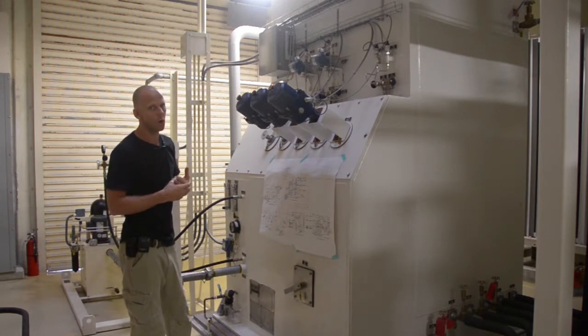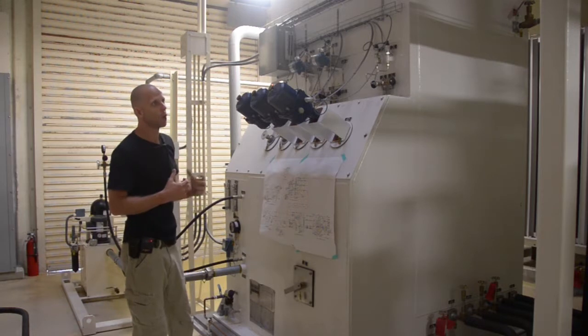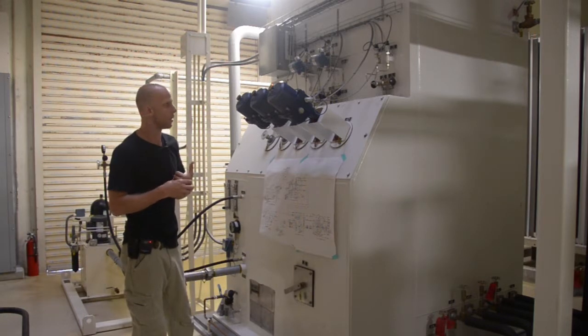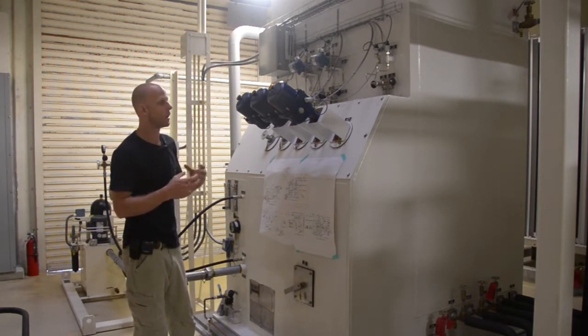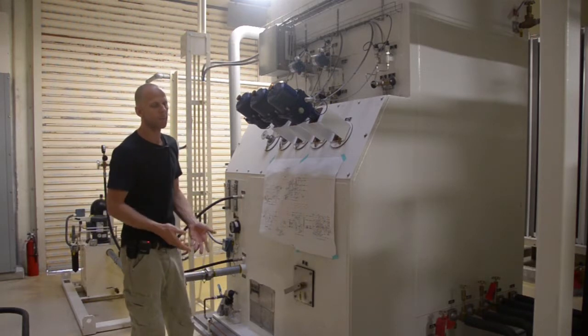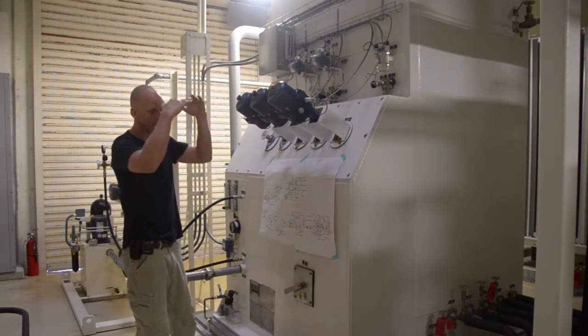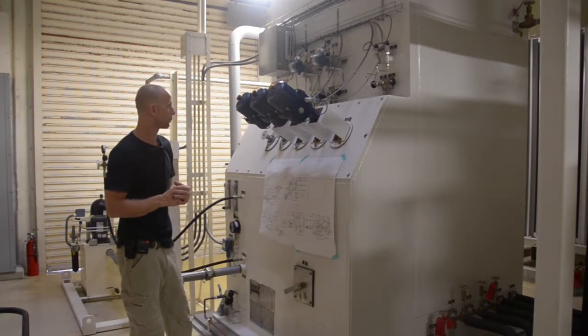It's only open during oxygen mode, and we use that pure liquid feed as a cold seal at the top of the oxygen column to prevent excess oxygen molecules escaping into the waste. That cold liquid nitrogen injected into the top of that column acts to condense any oxygen gas molecules that may be making their way up and into the waste stream. So they condense and they fall back down as reflux for that column.